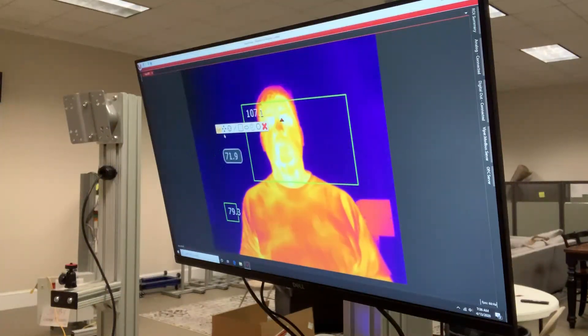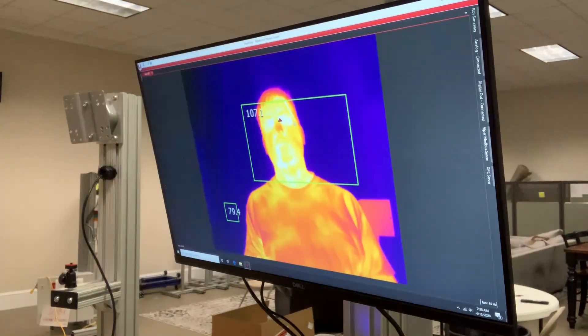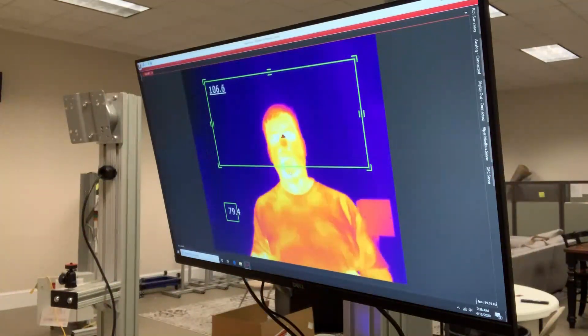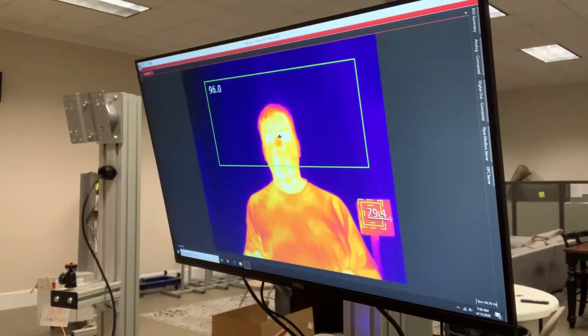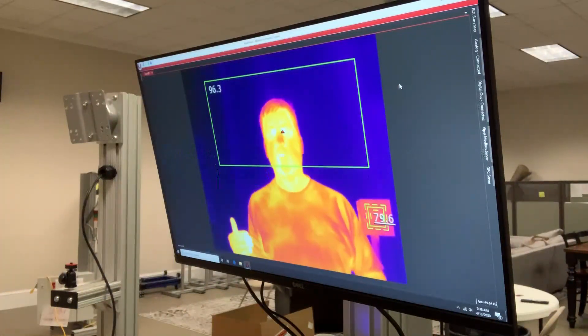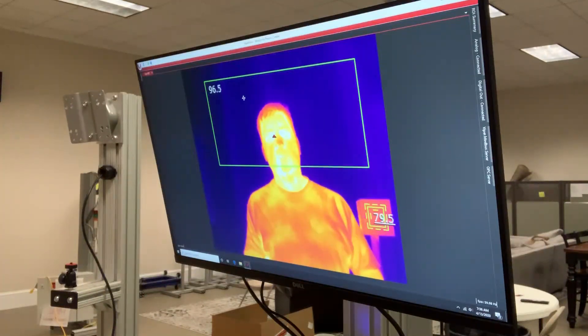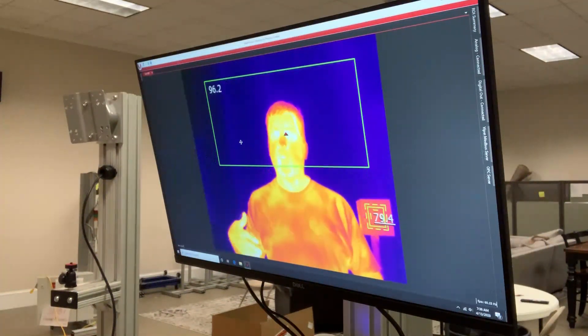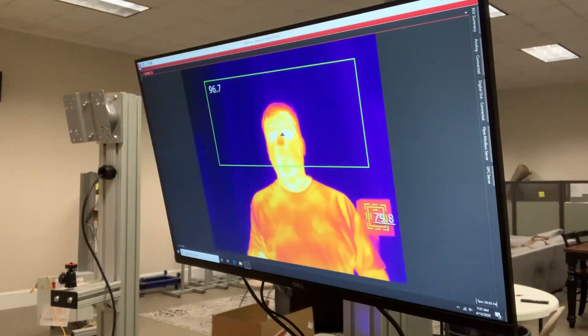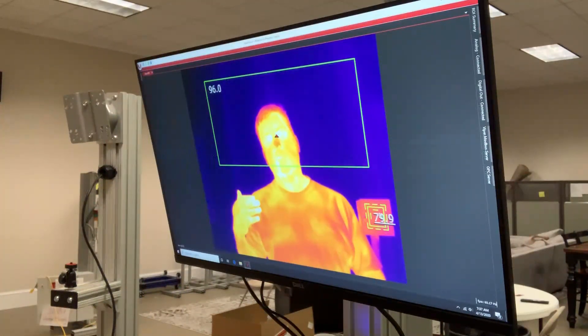Once you log in, you can move things around. If you click on the screen, you can use this button to move and resize the boxes however you want. You'll also notice that in the field of view there is a reference emitter. You want to move the spot over there to help compensate for any changes or camera drift. We did just crank this camera up, so initially you need to wait 30 minutes before doing anything. You'll notice my temperature dropped to 96 — once this camera runs about 30 minutes or so, everything should equilibrate to a more accurate body temperature. This shows the power of that reference emitter: even right out of the box, it's going to pull the calibration back into where it needs to be.